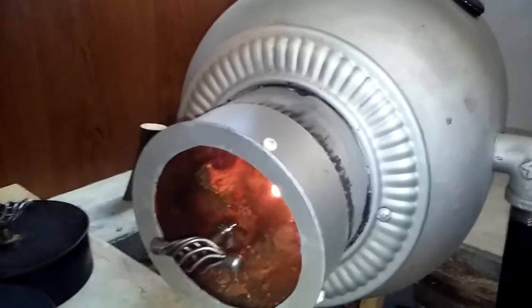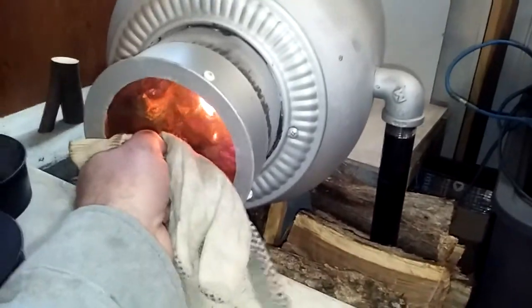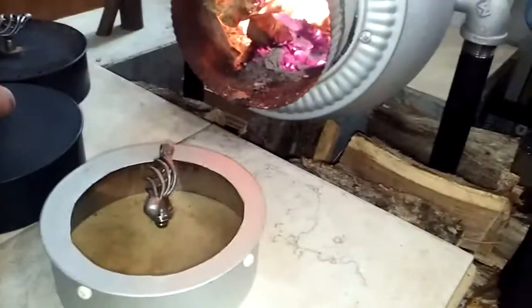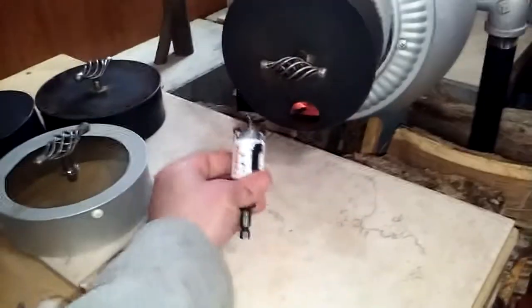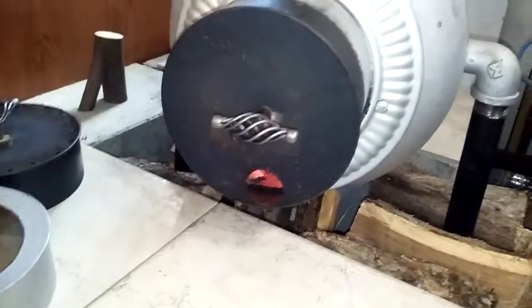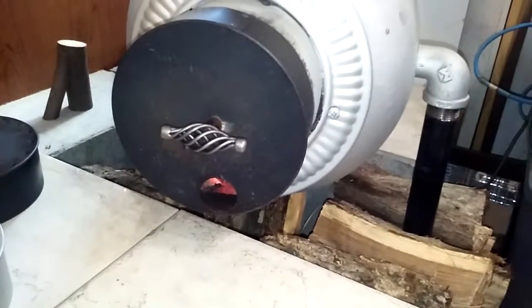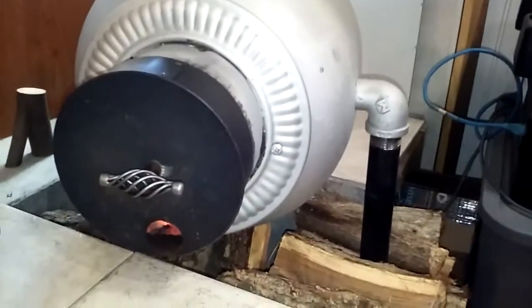As you can see, I used a piece of six-inch stove pipe here for the door. This might be a little hot — I've got some gloves, so I can just pop this off. I have several of these doors made up; this is the main one. It has a hole, which was made with the hole saw. That gets it going because it lets air in through the bottom. When you're trying to get a fire going, you want a strong draft directed in a good spot.